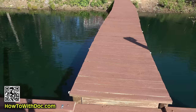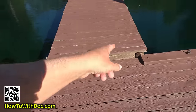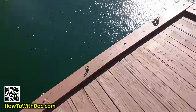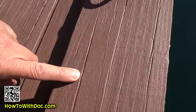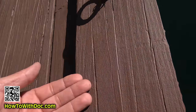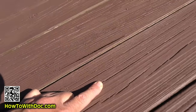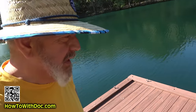I guess it's those polymer beads they have in it. That looks really good. The color is brown — you can pick any color you want. I'm probably going to get one more gallon and another brush and have Ryan come out and do the stuff I missed, these edges around the dock. If you come up to where I was applying it with a brush, see how these cracks are all filled? That's what I'm talking about — just like grout, you go cross-grain and fill those cracks. When I switched over to the roller, you can see I don't really have as much inside the cracks. But you can run your hand over it and it prevents splinters. If we come out and do a little touch-up here on the dock, we'll get another year or two out of this dock at least.